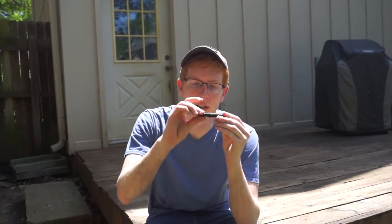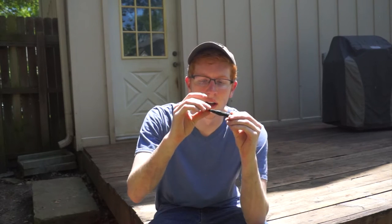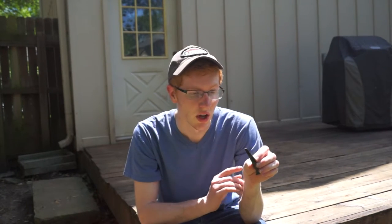So let's talk for a second. This is what I ended up with when I was done forging. I almost have the tip on there. I didn't make it a really pointy tip because I didn't want it to break off when I was quenching it, so I'm going to file that down. You'll notice I have this really weird bend on it. Originally I was just going to forge it out and make it as thin as that arrowhead and then put threads on it.